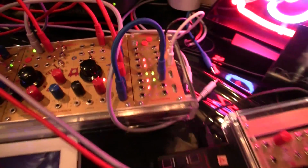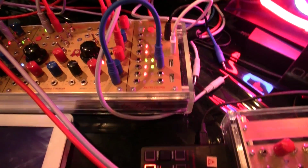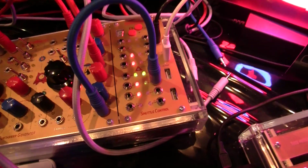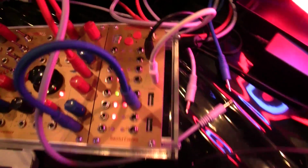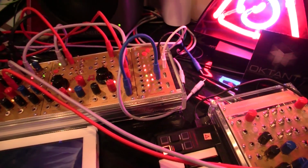There is the Buchla format 1.2 volts per octave, there is Eurorack or international 1 volt per octave, and there is a Hertz per volt linear scale, and you can mix all the oscillators you have from different scales. You can mix them into one polyphonic setup, and you will be in scale. There are different drum mappings. You can define literally any CV output to any triggering node, so you can trigger drum sounds from your MIDI keyboards or your sequencer or your digital audio workstations.